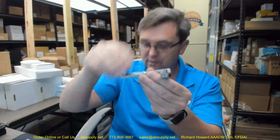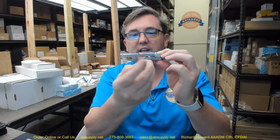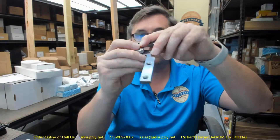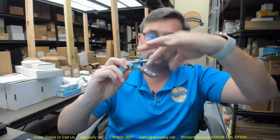There is a bronze bushing included that goes right between the two leaves. Once you have everything mortised and your cabinetry has the pieces attached, you will open your door to 90 degrees. You can have the bottom plate attached to the floor — it is not going to fall off. But you will need to hold the top pivot. Once you have the hinge top and bottom swung open to 90 degrees, bring your door and slide it right over the prep you have made on the top of the door. That is how you will then go about securing the hinge down.